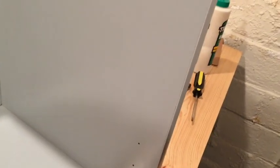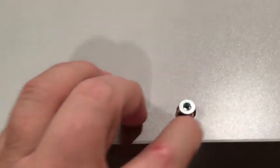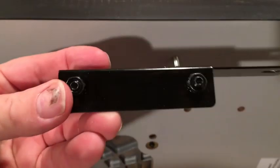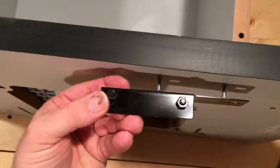The sides have drill-outs for hinges for the door. Next, the bottom comes — there are five screws and we use the side of the base that has a countersunk drill-out so the screws sit below the surface, as opposed to the side screws which stick slightly above the surface. Next is a bracket to hold the switch, which goes on the bottom of the top plate with recessed screw heads.